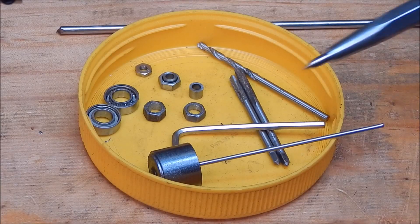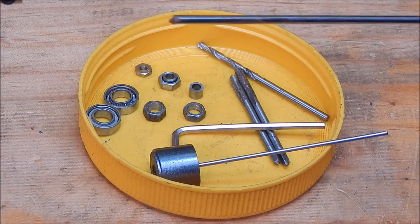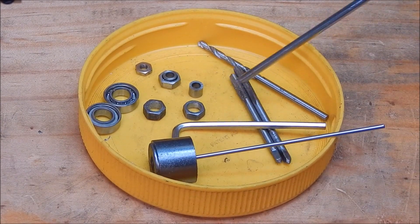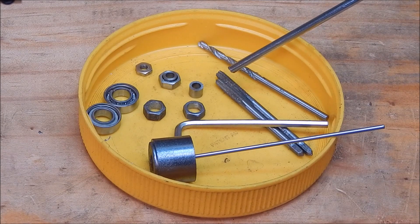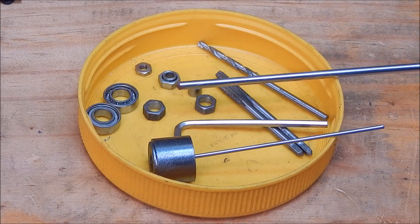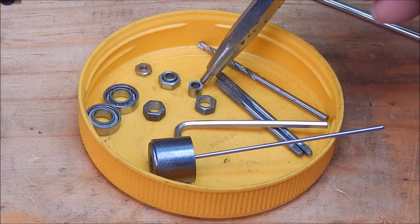There are all sorts of goodies in here. This is the graphite piston - it goes into the power piston cylinder and it will be loctited onto some drilled-out rod. You've got to drill out the centre of this stainless steel rod, which is tricky but doable - you can drill and tap this stuff. There are my 3mm thread taps and the drill for that. These are the ends of the conrods - imagine these nuts with a section of skewer between them, brazed on each end.